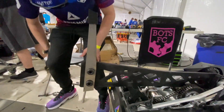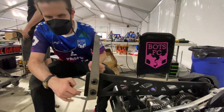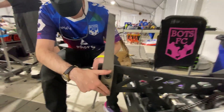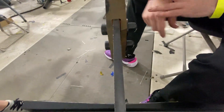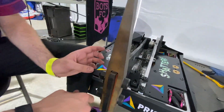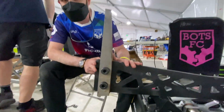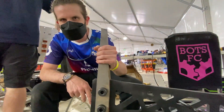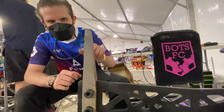I think we're calling this guy New Rusty. This is a heavyweight hammer, and it's got two gigantic bolts holding it in. These are much, much bigger than last year's bolts, and you can see they're going in a different direction. These are one-inch shoulder bolts, and they're mounted through one-inch ID, two-inch OD urethane bushings inside the titanium arm. So this hammerhead is shock-mounted up, down, and left, right, but not forward and backwards.